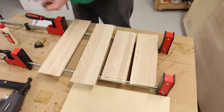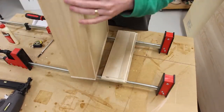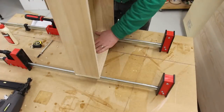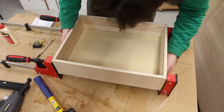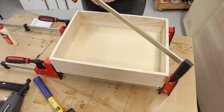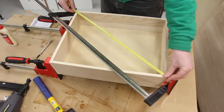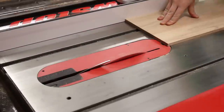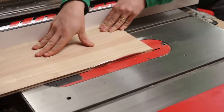The drawers were glued together and held in place with brads so I didn't have to use 10 to 20 clamps to get them all done at the same time. The drawer fronts got a 30-degree bevel cut on the top and bottom to act as pulls rather than using metal hardware.